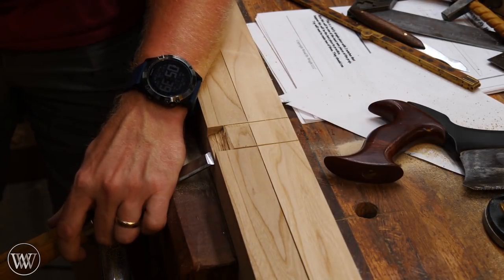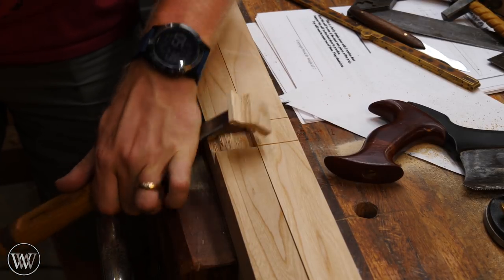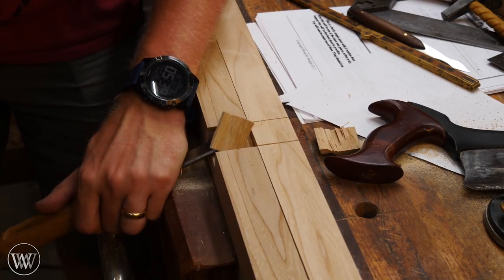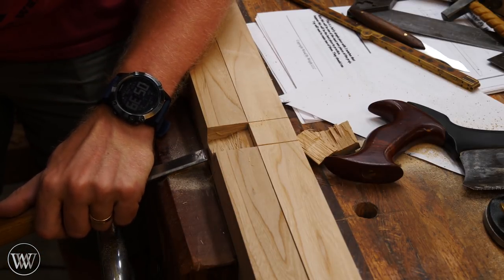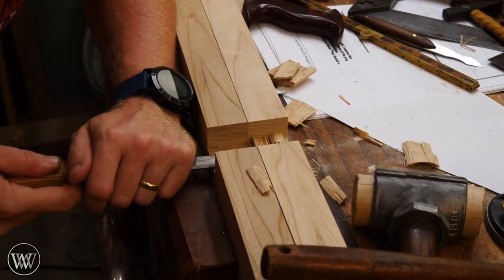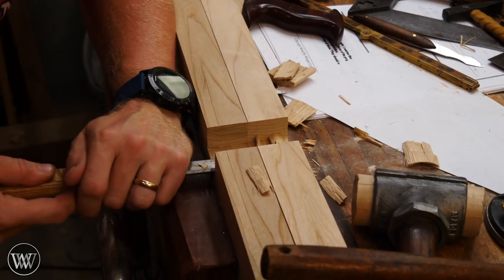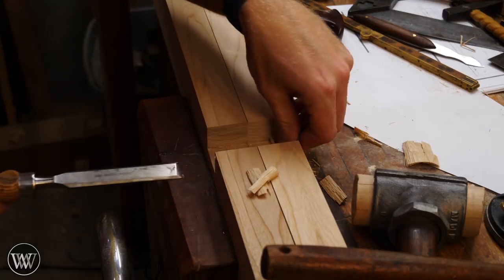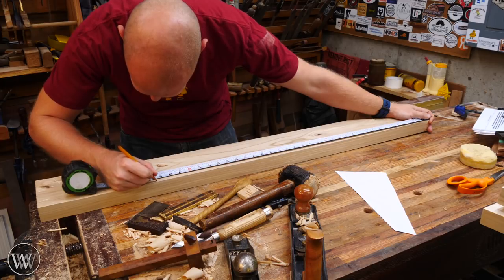This is really one of my favorite parts — once I've cut down either side, I bring a chisel in and chop out the waste. Not quite sure why it's so much fun, but it's very enjoyable and very relaxing to see these large chips come out. As long as you take your time and be careful — you never quite know where the grain will run on elm, and you may end up going the wrong direction. But if you're aiming up and away from your work, you can work back down to that line slowly. If in doubt, leave a little bit extra, because when it comes time to do the joinery between the two pieces, you can finesse the line and make it perfect.